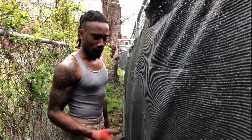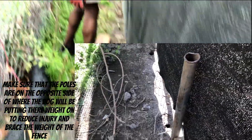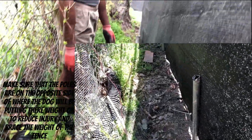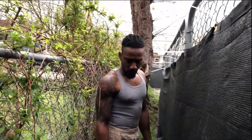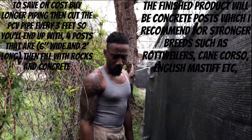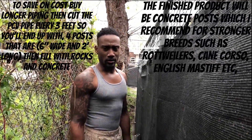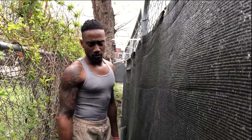Because when you have a heavy dog, such as my Rottweiler, they like to push on fences. We've got this from the start all the way to the finish — that's how you strengthen the fence up. And if you want to make it even more secured and powerful, you can get a roughly 6-inch wide PVC pipe, roughly 12 feet long, put some rocks in there as well as concrete, then put the post in there and secure it even more.